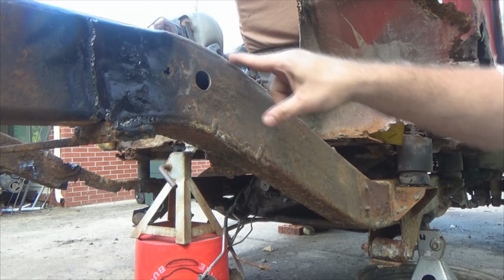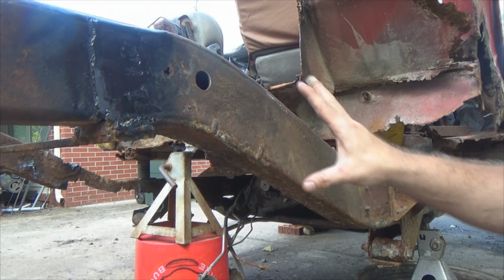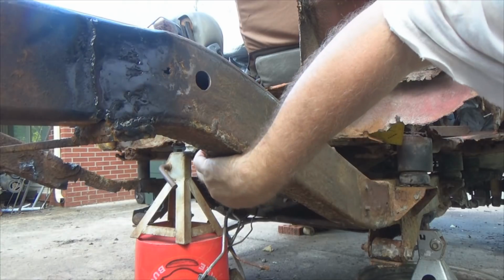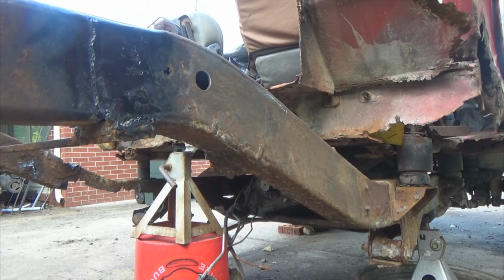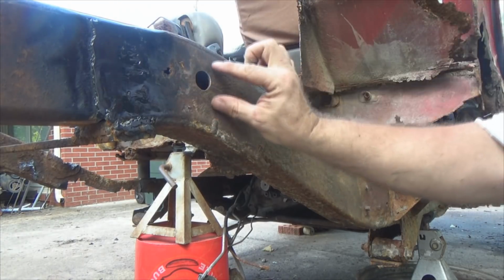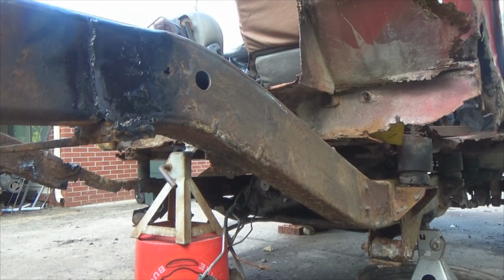Now I took the flap wheel, ground all that to bare metal through here, top and bottom. Being that I'm over here, I'm actually doing some different patching. I'm going to take the plasma, cut that out, and replace that. That's a different issue, so ignore that part. But take all your edges, make them like this before you lay the protective paint, because then you're going to come back and grind the paint off to make sure you get a good solid bite for your weld.